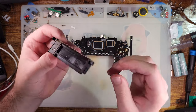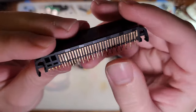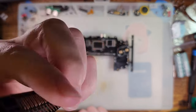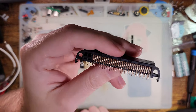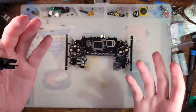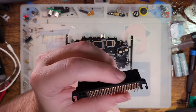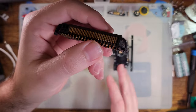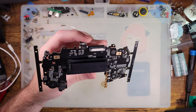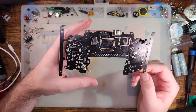One of my concerns that I did already bring up with them was that I noticed the pins on the cart reader, they're just bare copper. So I don't know long-term how that's gonna hold up. Copper will work harden. But copper is also a highly reactive metal, so it's going to patina, which if you have a housing made of copper, who cares? It's going to look cool. If you have an electrical contact made of bare copper, not so much. Right now, I can say it does work pretty decently, but what's to say it's going to keep working in 5 years or so?